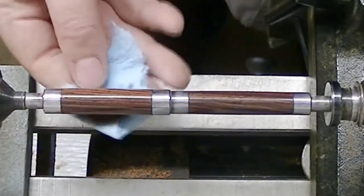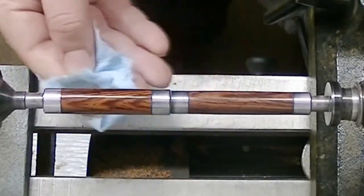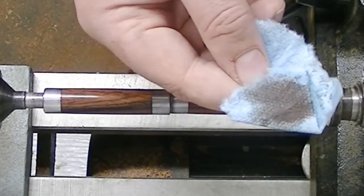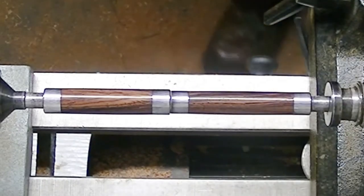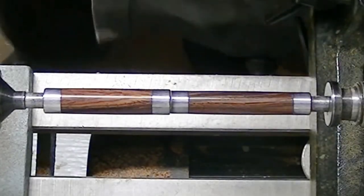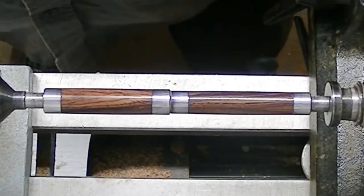It's still seeping all that oil out, so we just rub this a little more to get some of that oil off. It's not as dark but still seeping out quite a bit. We'll let this cool down — I usually leave it anywhere between 20 minutes and an hour. Once that's all cooled, we'll wipe it off again with denatured alcohol and then apply our liquid finishes.